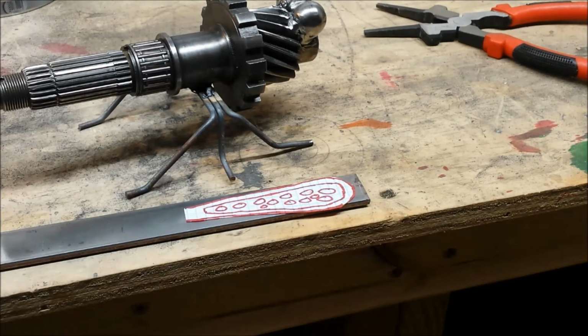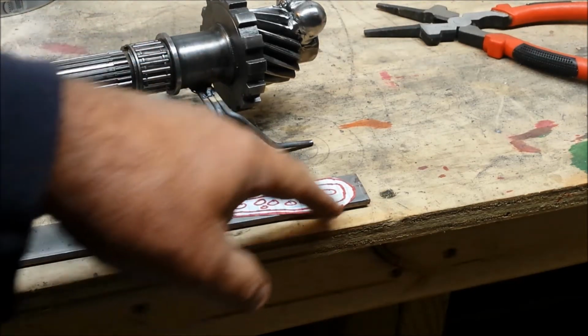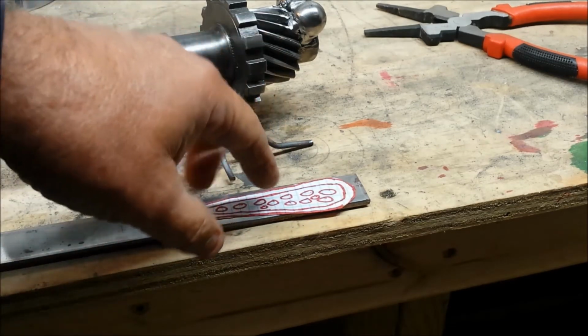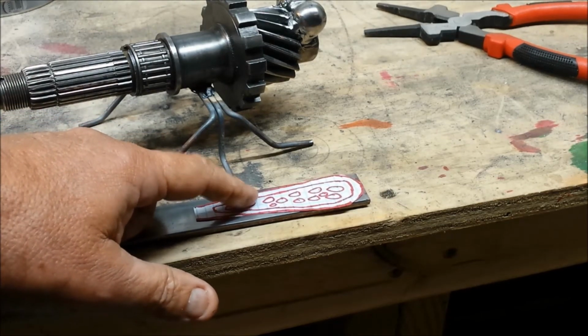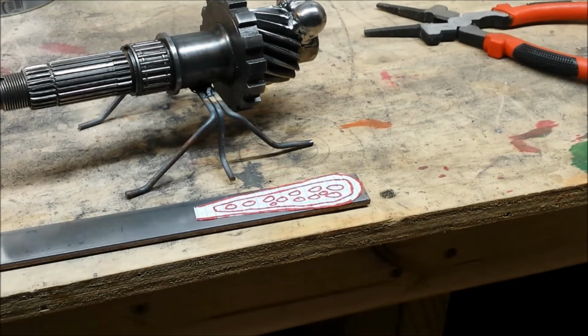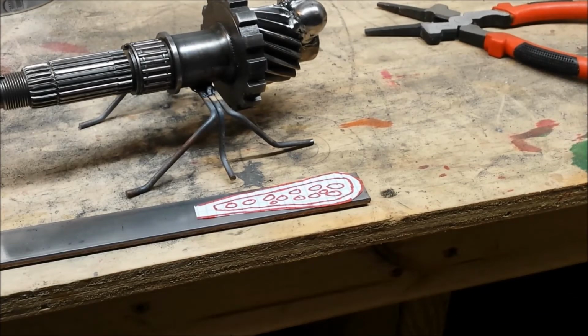So what I want to do is I'll drill the holes, and then we'll put these wings in the forge, and with a drift I could shape these holes, and if I leave enough meat on the outside of this edge, I'll be manipulating the metal really in the center. It might be a nice effect, or it might turn out to be shit, but we'll have to find out. So 4 inches long, 4 of them. I'll use 16 inches of this 26 inches of flat bar, so I have room for one mistake anyway, or 2. All right, and that's it. Get to it.